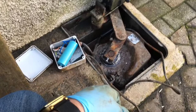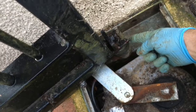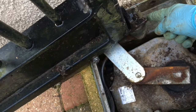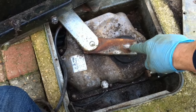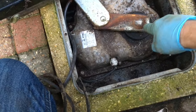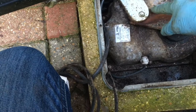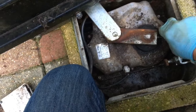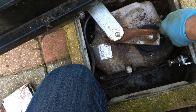While you're at it, give it a good grease up around these joints. There's a grease nipple on this joint over here as well which could do with greasing. Very often these splines get worn on these electric gate motors — they can often wear out so much that the spindle of the motor turns independently from the control arm.